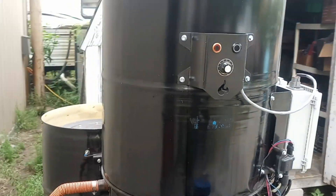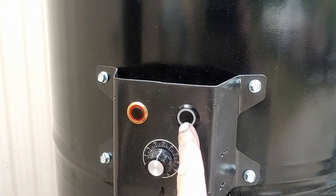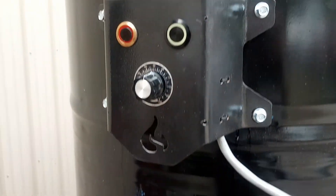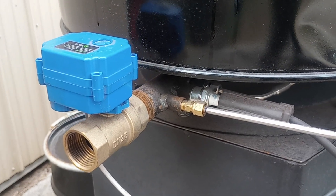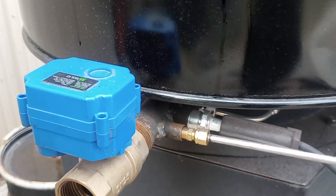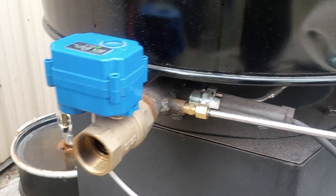I'm going to make sure I have my torch available. This here is your mode button, so I'll shift to yellow. What that did is it opened up the gas supply valve, because this has self-ignition. It basically opened up this valve right here to supply some gas to the intake, and then there's an igniter in here — so when this is fully functional, this will self-light on its own.